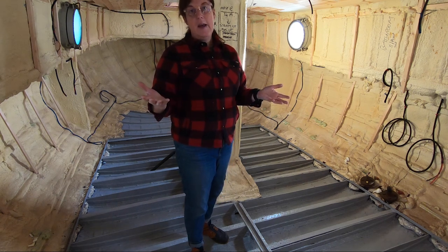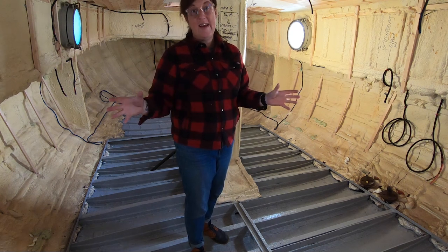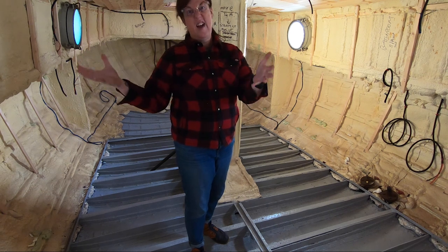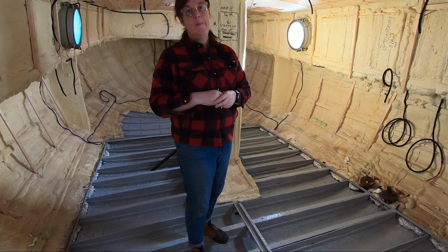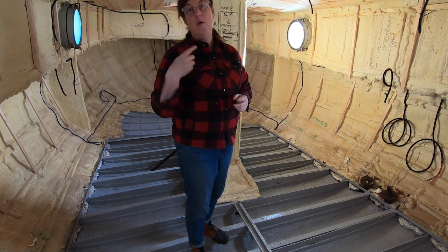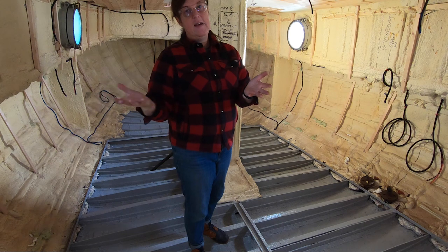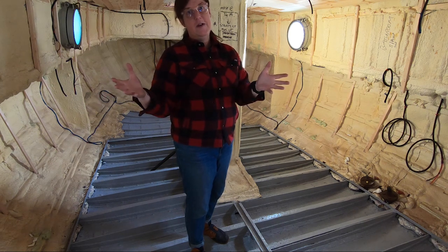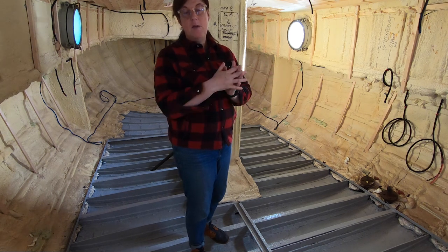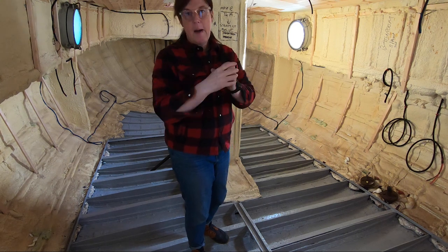Now, I spoke to the heating engineer because the heating system does 2 things. It will do the central heating for the radiators, and that is a water-filled system. So the radiators all have water inside, just like a domestic central heating system. And the boiler will heat the water up, and pump it through and warm up the radiators. It also has hot water, and it's very much like a domestic system, but this is an off-grid version. So the hot water needs to be set up with a pump, so that it's pressurised. And for the hot water system, there'll only be 1 pump, and that pressurises the system.